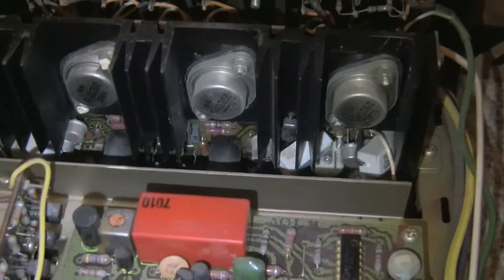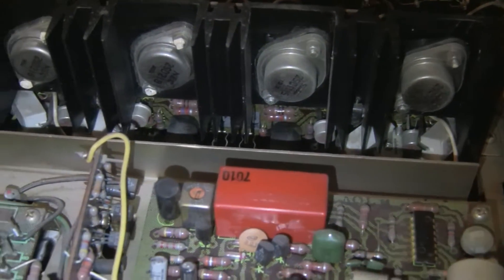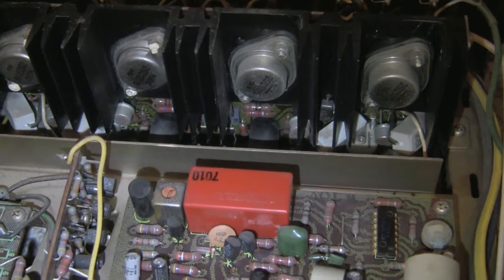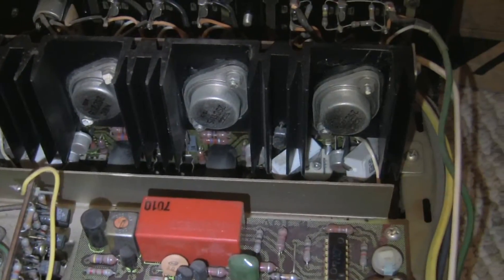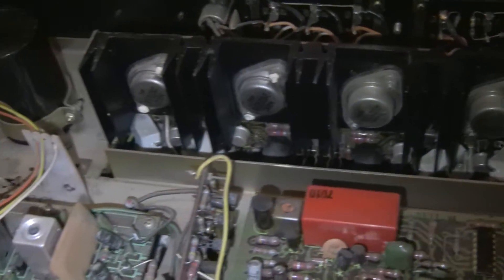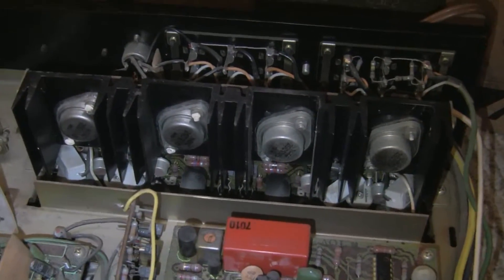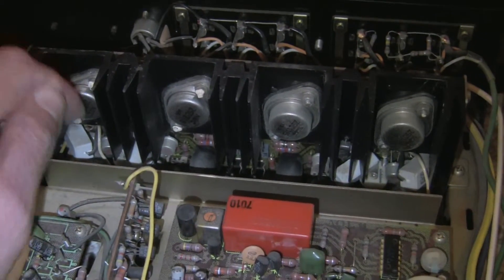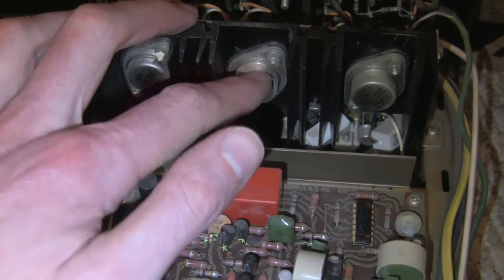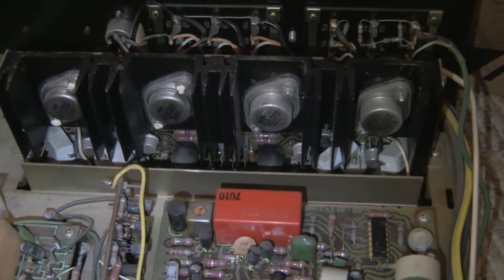I'm going to re-engineer this circuit — it'll be time for the whiteboard and some math about current gain requirements. I'll use their same basic circuit but recompensate it and use some more modern parts. It'll still be quasi-complementary when I'm through with it. This receiver is rated at 58 watts with one channel driven and has kind of a small heat sink. Really, these 7-amp 60-watt transistors are not adequate for that power level — the Sankens are probably more appropriate. These were replacement devices, and that's probably detail for another video.